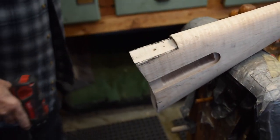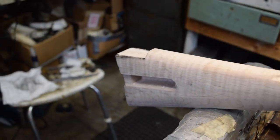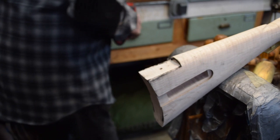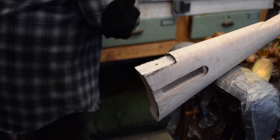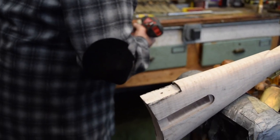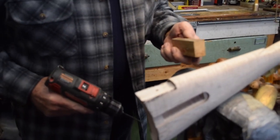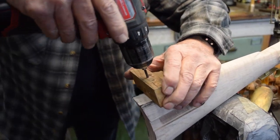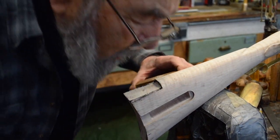Okay, we've got the shaft in. Now I'm going to use a number 29 drill and pretty much do the same thing. Now we just use a different hole here. Put that in the hole. Put the block down, make sure she's square, both sides. She's done.